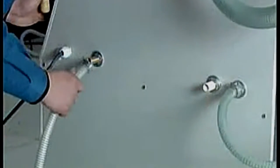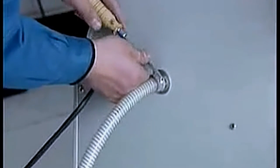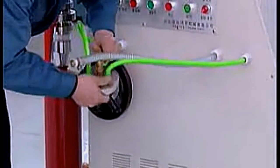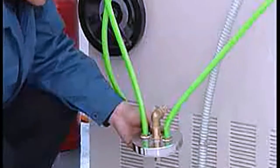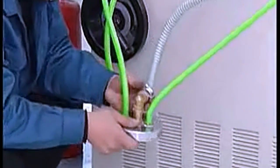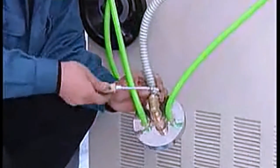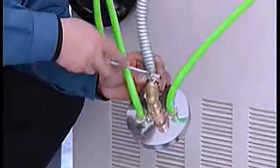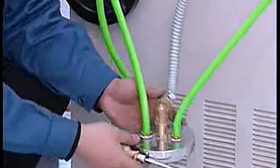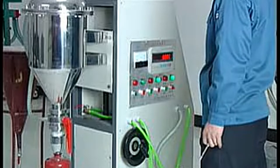Procedure for filling 35 kg and other large capacity fire extinguishers: connect the powder source pipe with the 35 kg powder suction inlet. Take out the 1–8 kg powder suction pipe. Change to the 35 kg powder suction pipe and pressurize. Tighten the fastener and pressurize. Then start filling. Under working order, the machine will auto-clean the filter when finishing filling one fire extinguisher.